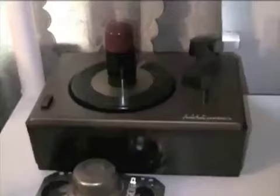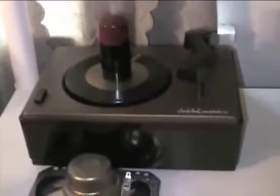It's a mid-50s GE AM radio with a phono hookup, and it will be perfect for my RCA 45 players. I did not plug this in, but according to Spats the radio does not come on, and he's assuming that one of the tubes has an open filament, because this is probably one of those five-tube string-type rigs.